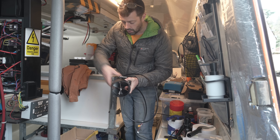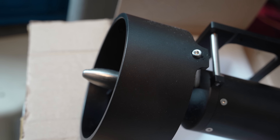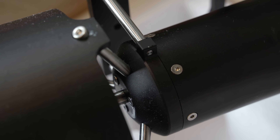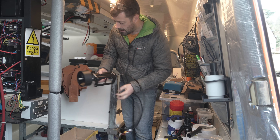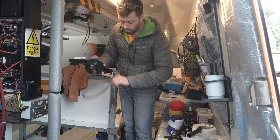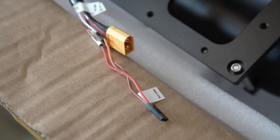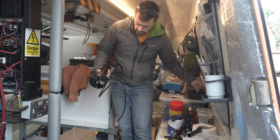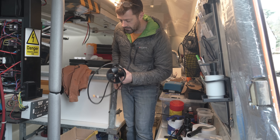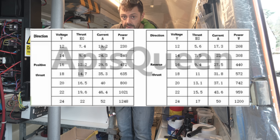So I think what they do is they have the motor pod unit itself and then maybe they attach their own frame, prop, prop guard, and then inside there is a built-in ESC — that's the electronic speed controller. So that is the all-in-one unit that then all it requires is on this end power, and then a three pin connector for the actual dial which is actually here — just a little PWM. So the idea being that this has a thrust of, in its current configuration, 22 kilograms.